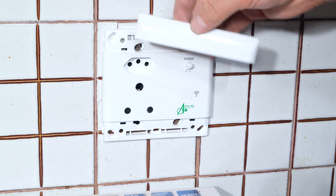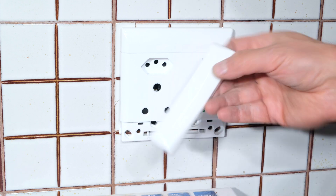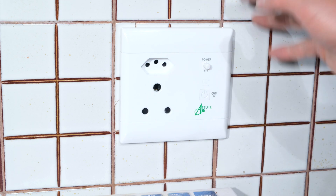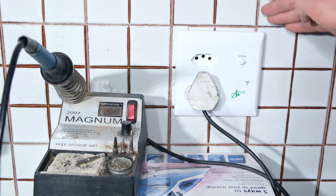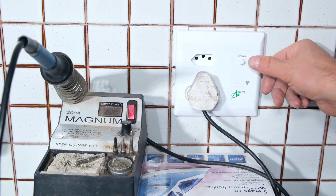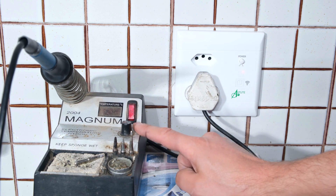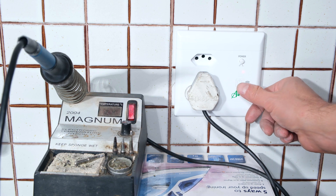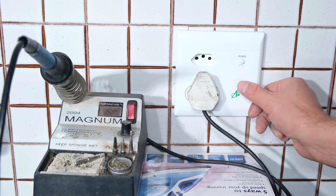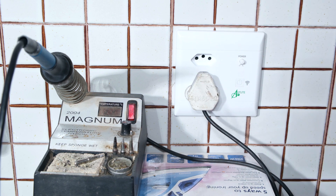I can now return the covers. These covers are unidirectional - on some outlets there may be a brand insignia so check it's the right way around. The outlet is now installed and I can turn on the power. After energizing the mains, the live and neutral at the back are now live, but the unit itself is off. There's a small button I depress and a small LED that lights up. I've plugged in my soldering iron to test - pressing the button on the side turns the device on, and pressing again turns it off. I can also press the main button to turn off everything.